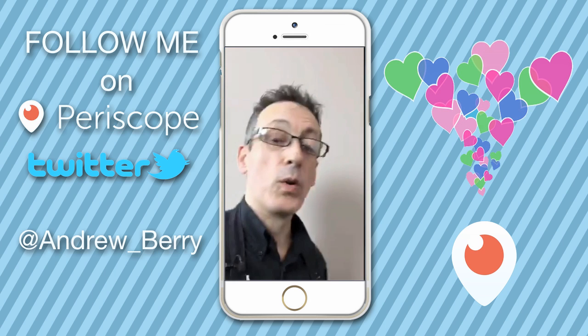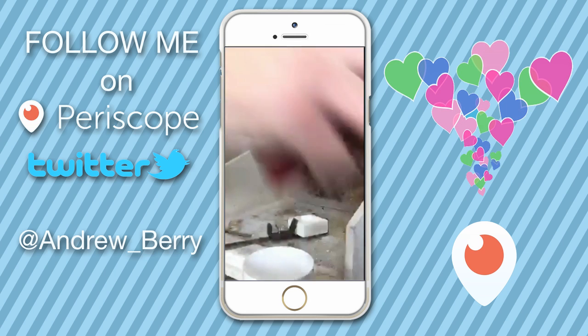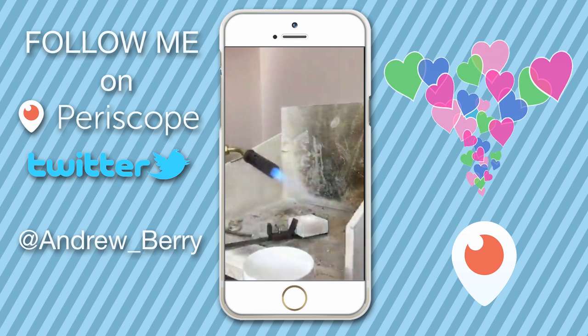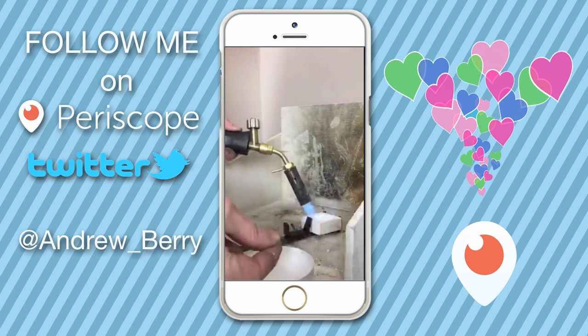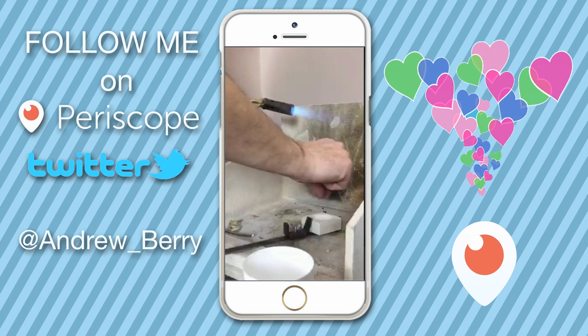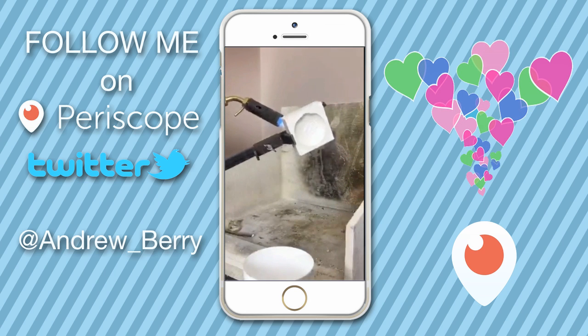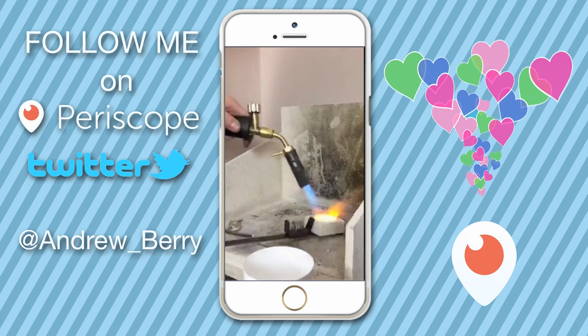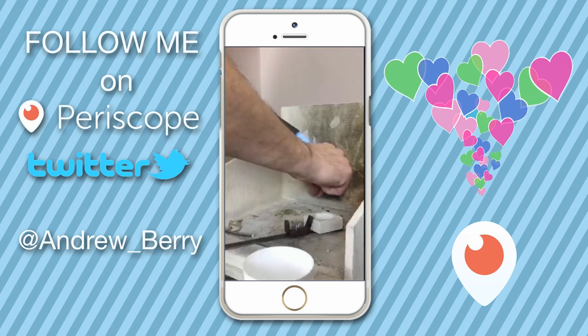You'll have a bad case of what looks like dandruff. So what you need to do first is make sure the crucible is nice and hot. I'm using an old Sievert torch here — you can use one of the handheld butane torches as well. Once it's hot, we're going to sprinkle some of the borax onto the crucible, and what's going to happen is that borax starts to stick. We want to make sure the whole area of that crucible is covered with borax.